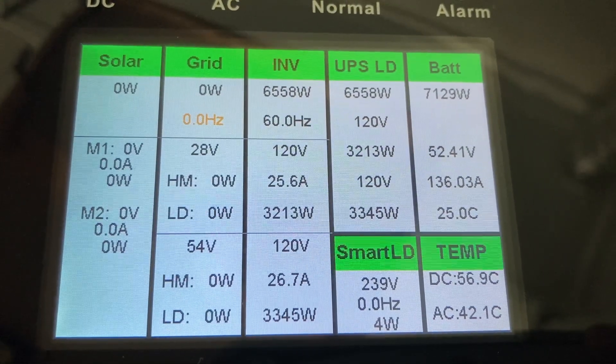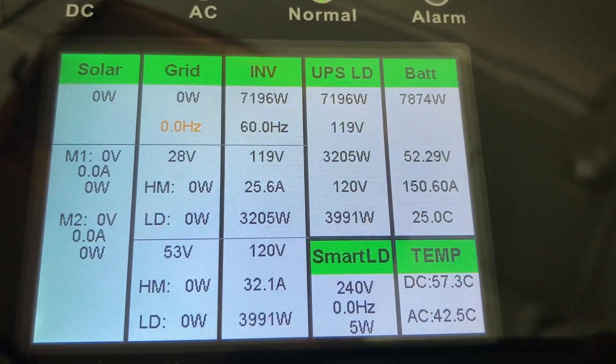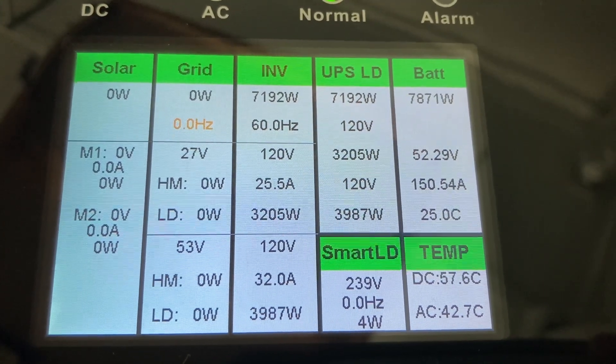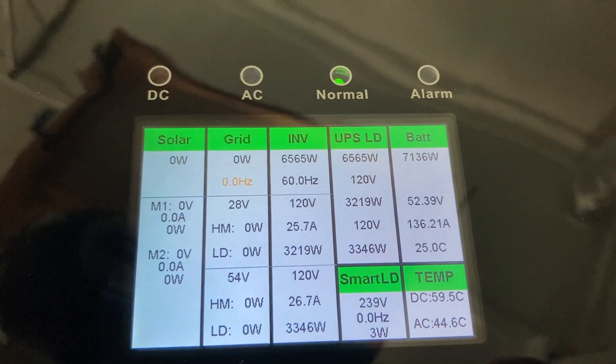In the next example, I am going to keep the lights as a very small load. I am also going to keep the 6000 watt heater as a large load, and I will turn on a 140 watt small load on lane 2 and increase these loads with a heat gun on low setting, so the total consumption is between 7.8 and 7.9 kW. Solar is still doing okay.